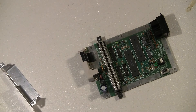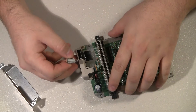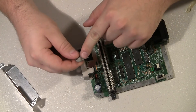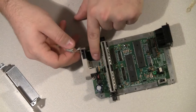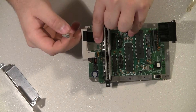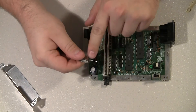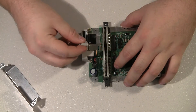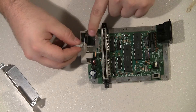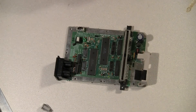On my connector, this is just going to be a dual mono mod, not a true stereo. So I've actually soldered left and right together on the connector. Audio is available right there, right where we took the RF modulator out. This is actually a leg off of a capacitor or resistor that I cut off a long time ago. So after I get the AV mod wired to the connector and shove it back through, I just poke that down into the audio hole and solder it on.